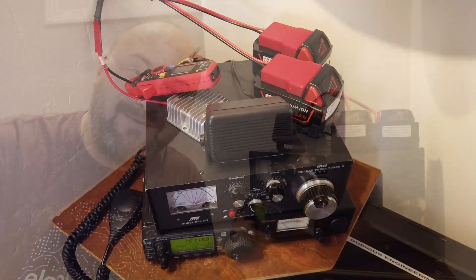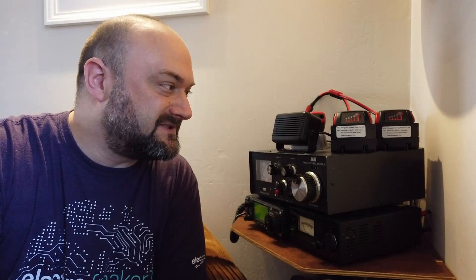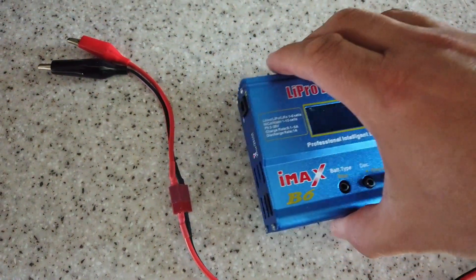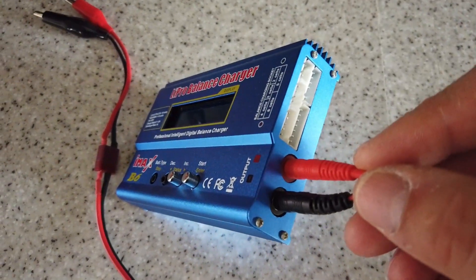That's pretty good. Now if you enjoy QRP operation - low power operation - I believe you could run this system for between 10 to 15 hours before needing to recharge. I have a charger that runs from 10 volts to 36 volts called an iMax B6 - completely configurable, only about a tenner - and it would work quite happily charging these batteries.